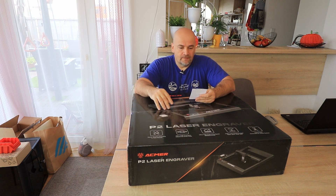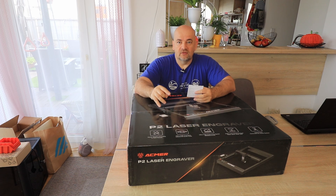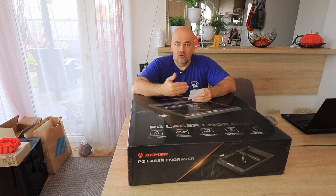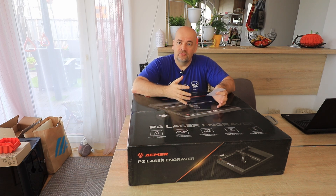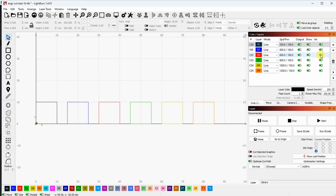This is the real optical power. It has an automatic air assist pump, which is great because since I am using LightBurn I have the advantage of being able to turn the pump on and off by software. Because don't forget — with engraving you don't want to use the air assist pump, only for cutting.